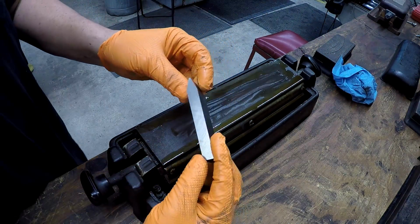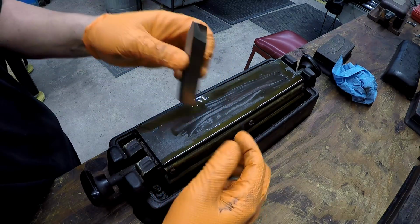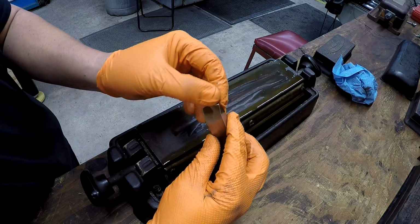This is a tool that I've been grinding up to cut in the sides, and what it's meant to be used for is either direction. So you can come in and cut on the left side or come in and cut on the right side. It's going to have a neutral rake. We're just putting a radius on the end of it right there.